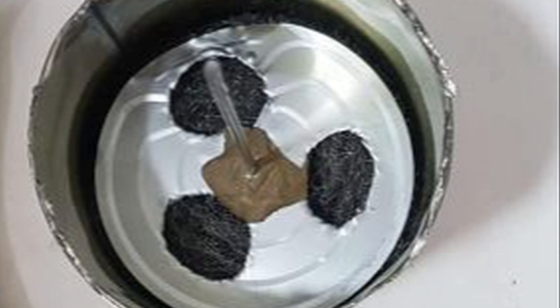For everything else, make sure that the displacer is a tight fit in the pressure cylinder, but not so tight as to cause friction. The displacer, if you let it go, should fall under its own weight easily. If it doesn't, you have too much friction.